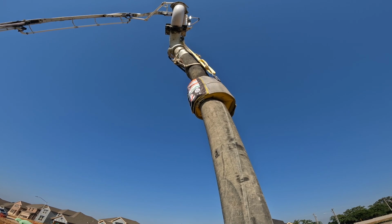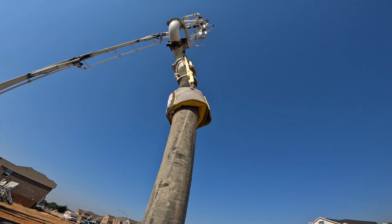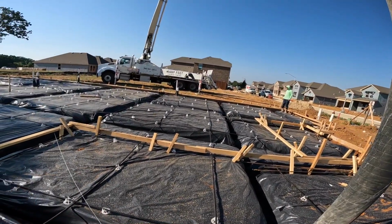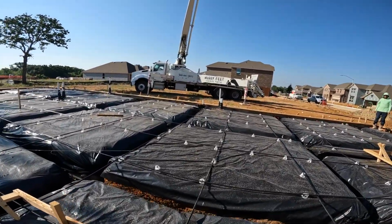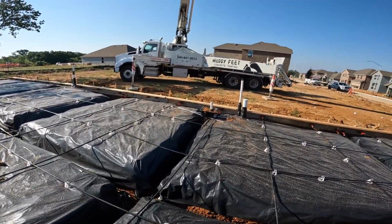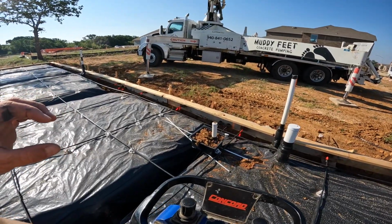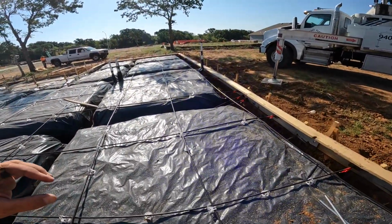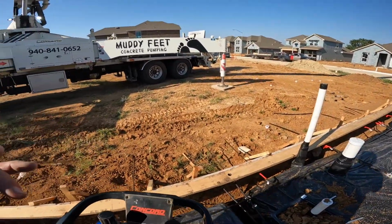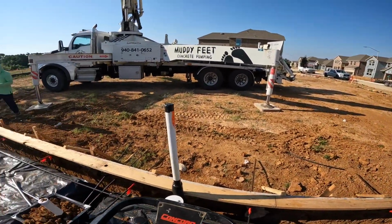Alright? And then when I turn it off, it bleeds the air out. And that's how long it takes. Long story short, y'all have seen, we did other videos on the installation. It's an air line coming off one of the auxiliary tanks. There's a shut off valve, goes into a pressure regulator, where you can set it to a certain pressure. You know, different size hoses, a steel hose versus a nylon, you may want more or less pressure on it.